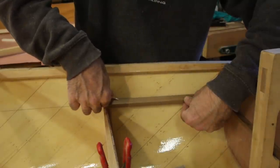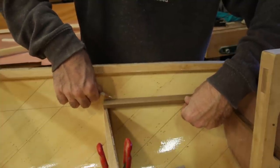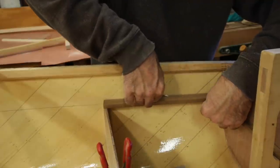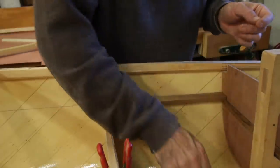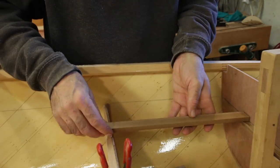Scribing, usually you want to make sure that you're keeping your compass parallel, in the same orientation through the whole scribe. And this technically would not do that, but it's not a ton of shape here, so it's close enough. So there we go, we've got that.